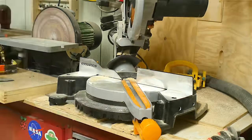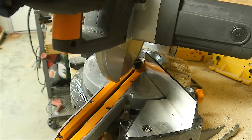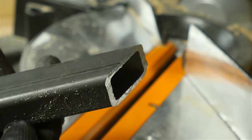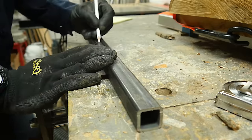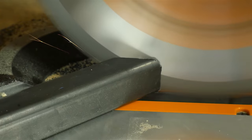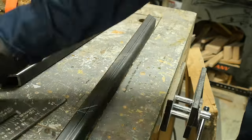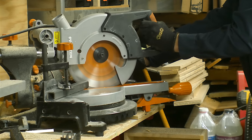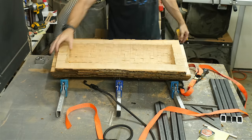Then it was time to make the steel frame for this bench. I used my new miter saw to cut the steel for the first time — they're not a sponsor for this video, but I have to say I was really impressed with how well it worked. With other saws in the past I've had trouble with deflection when you're cutting an angle, but this one actually cut a perfect 45. I measured out the short side of this piece of steel to match the width of the log, then cut the other miter on the other end. I did a test fit to make sure that it fit inside the log and then just copied its size onto another piece of steel. I cut this one down as well — these will act as the top and the bottom.